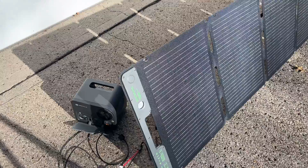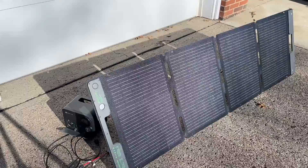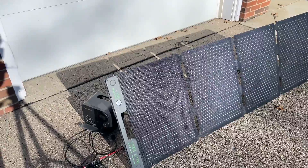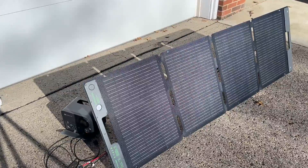The sun is going to move, so you also need to move the panel as the sun moves for the most optimum charging. That applies to any solar panel without sun tracking. On a really sunny day it matters less, but today the panels are almost upright because they're facing south in wintertime. In the summer, the sun will be more overhead and the panels will be able to take in more power.